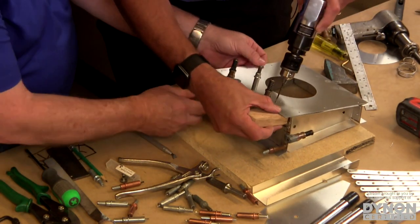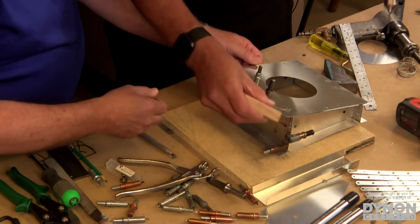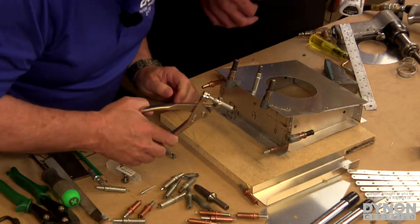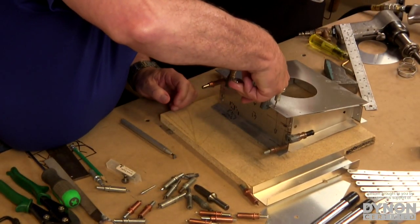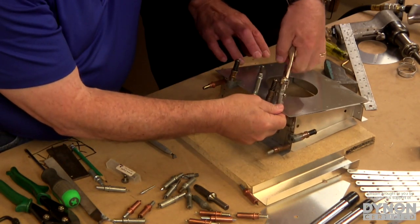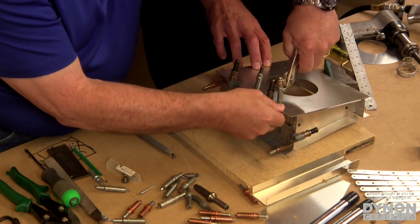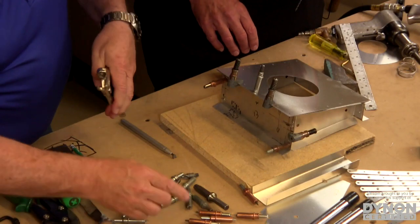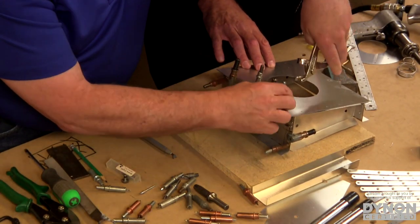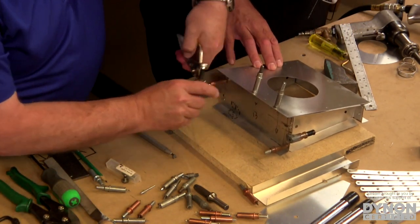And we're going to come over here to drill. Okay. There you go. So then put another Cleco in. Now I'm going to drill one more hole using the battery drill, just to give you an example of the difference there. Get this Cleco in there for you. Yeah, perfect. Whoops, I didn't get the whole thing. That one's a worn out Cleco. We're going to replace that with one that might actually hold. Perfect. There we go. Get this clamp out of the way. So when we have at least two Clecos in there, it's not going to be moving around.